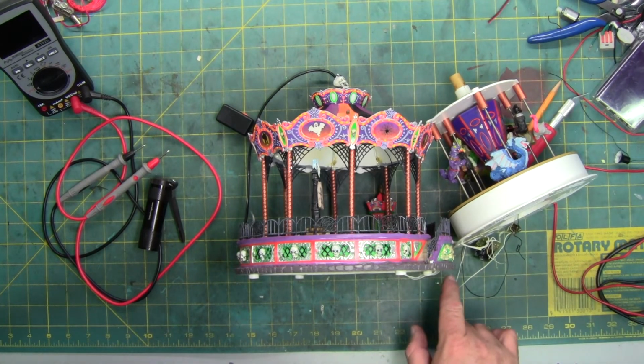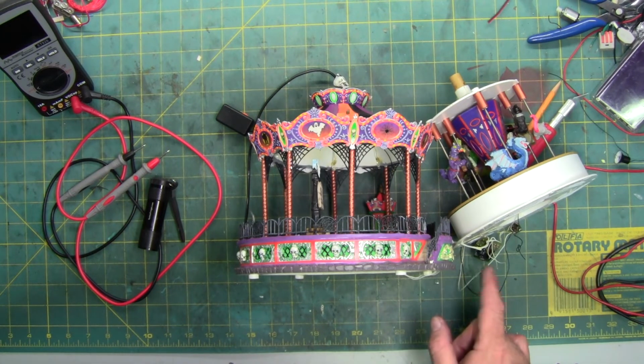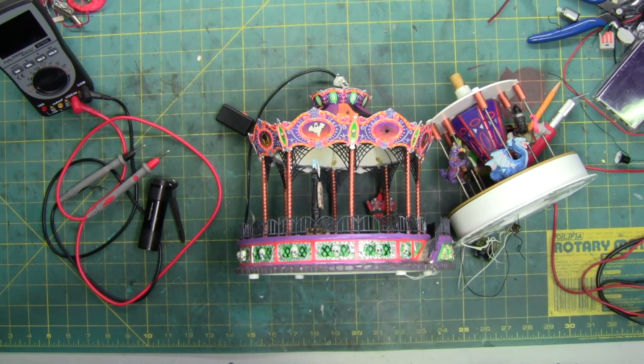They're printed on the side. It's easy to figure out. The ceramic one, though, does not have a marking. So, how to use a capacitance test. It's coming up at 73 nanofarads, give or take 10% for most electronic components, just to give you an idea